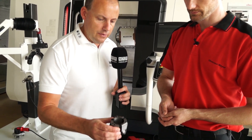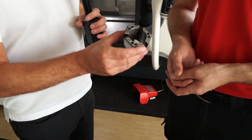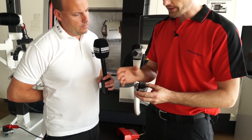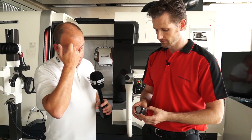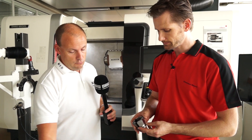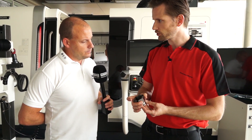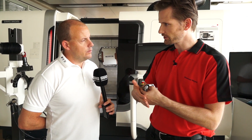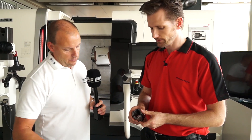This is an example of another clamping head — the hexagon clamping head version. I would, without hesitation, recommend this for bar work because it's much more rigid. From a hexagon perspective, in practical use the clamping forces are higher. The hexagon makes it more resistant to contamination and also reduces vibration because you have full surface contact. The surface contact across flats is far greater than it is on the diameter.